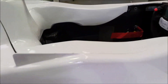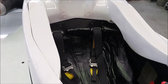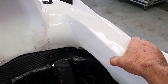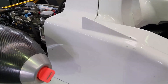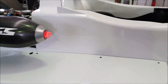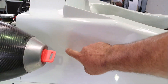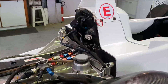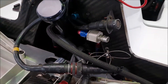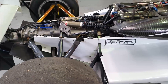Very similar inside — it still has the head protection there, the large high-density padded area, and the fuel tank essentially sits behind the driver at the bottom of the car and back up again. It's a very heavy bladder that needs to be recertified — it has a time life, they don't last forever, and they need to be replaced after every couple of years of service.